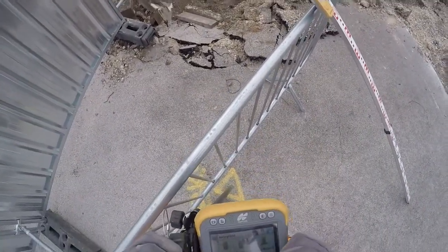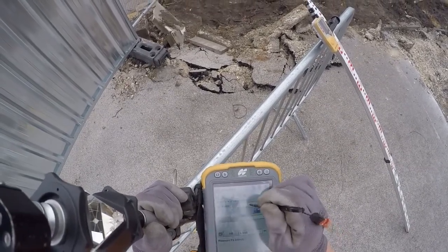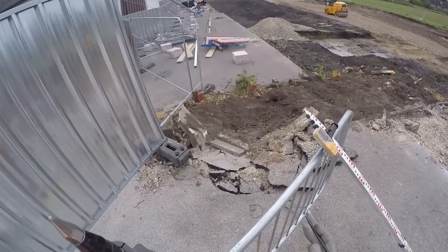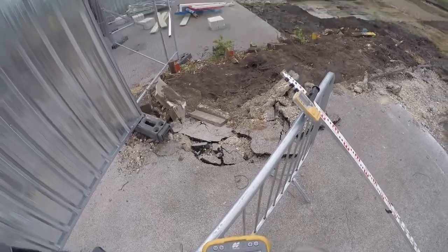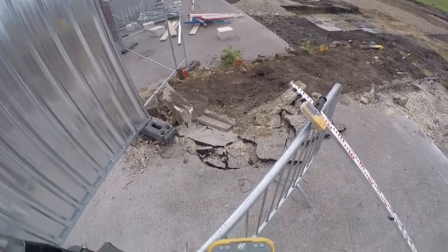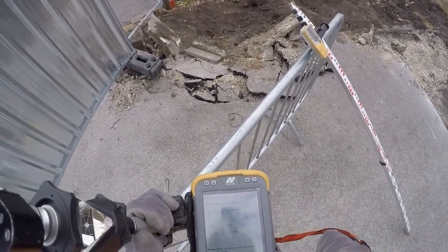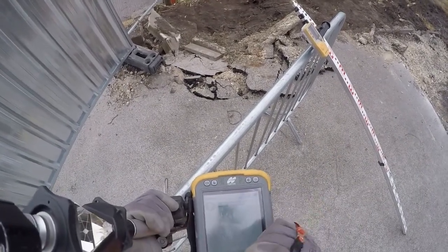What I need to do is come into this screen, click resection, and specify an occupation point for the machine — otherwise it's only a temporary spot. I'll be leaving that as temp, but if you're over a station you could put the station name in there. Height of the instrument you leave at zero for purposes of this. This is one I've done earlier so I'm just going to remove these.